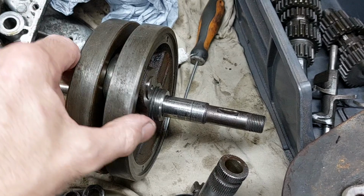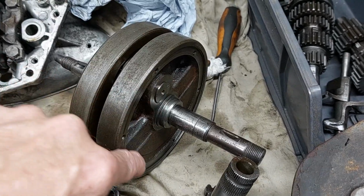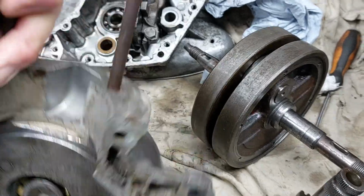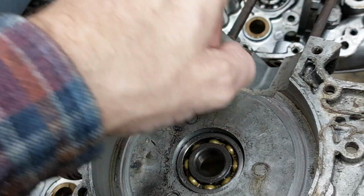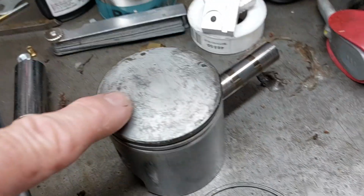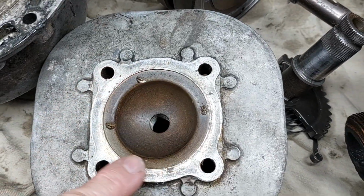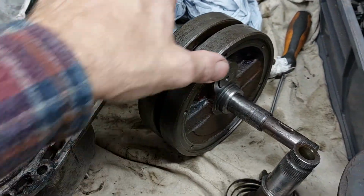So here's some of the problems. The first one is, which I knew about and suspected had happened, this stuffer plate is missing. It's obviously come loose. And then this screw was gouged round inside the housing, causing untold noise and damage here. And then eventually the screw's flown out and gone up above the piston, routed around, damaged the piston a bit, and caused some damage in the cylinder head, which I thought may have caused a problem with the crank, and it has.